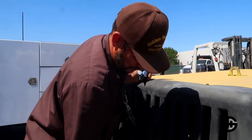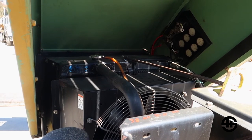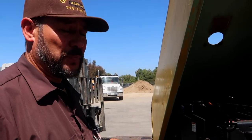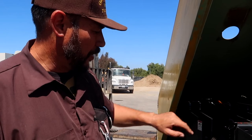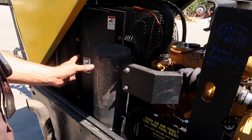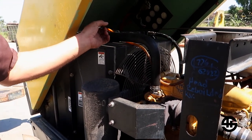I think it's gonna be a simple fix. Here's what I think it is: we have a very small radiator on this unit — it's literally half of the whole assembly. The engine temperature seems fine at 181 degrees, but the minute I close the hood, the temperature increases to about 200–230, which is way too much. The fan is sucking air through, but instead of cooling, it's actually heating — because this muffler sits right here running at 600–700 degrees, siphoning all that heat into the radiator and heating the water rather than cooling it.